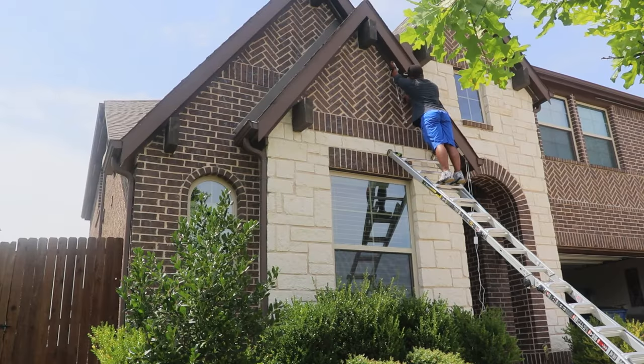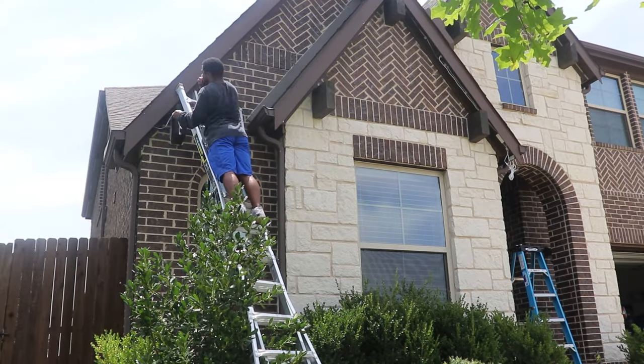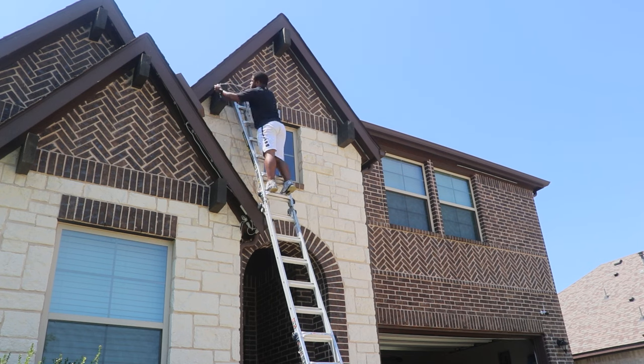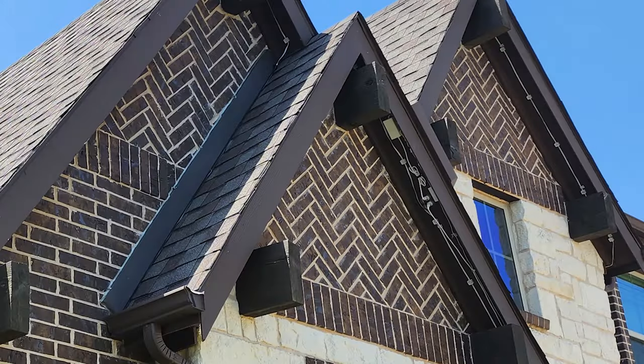As far as installation goes, these things were super easy to put up on your house. The 3M tape on the back of the square LED lights is very good. The only few issues with installing: if you end up with the wire being loose at all, your 3M tape will likely fail on one of those square LEDs, so you'll need to use your additional clips and brackets to secure it to your roof. Issue number three — why are they only white? Do you know many roof lines that are white? Because I don't. My roof line is not white, so these things stand out. If you're standing under my house, you can absolutely see the wire and the square LED.